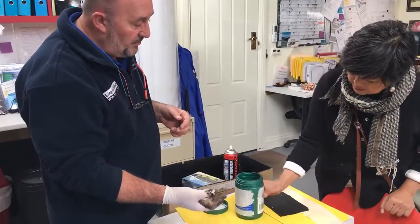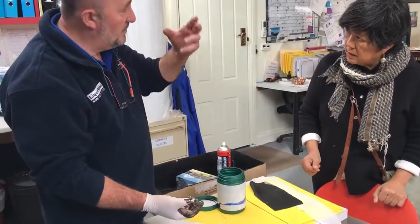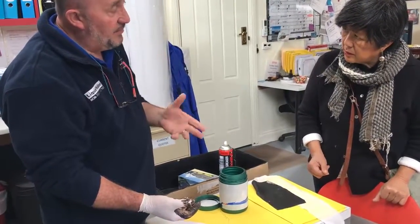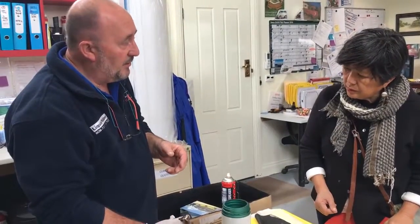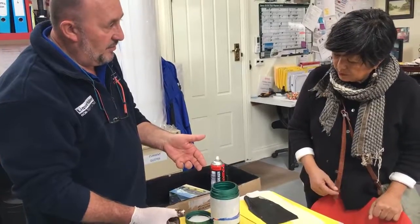One of the biggest ones is what plumbers use, Blackjack, and that's out of a can. They put it on a lot of their flashings and roof fittings. They're great for a few years, works very well, but then it dries and cracks, and then there's problems. This stuff doesn't dry and crack out. That's the whole purpose of it.